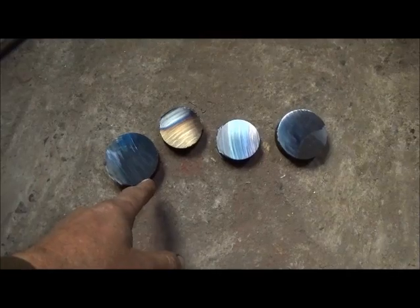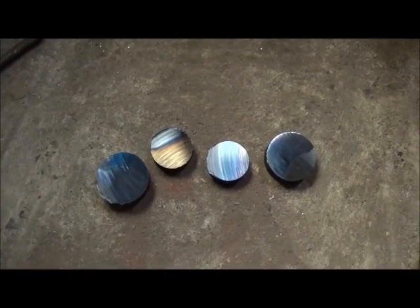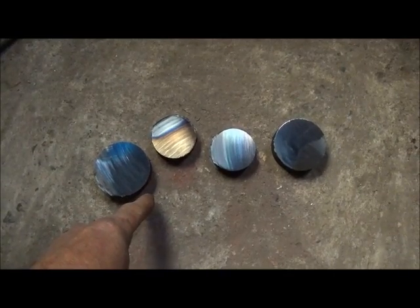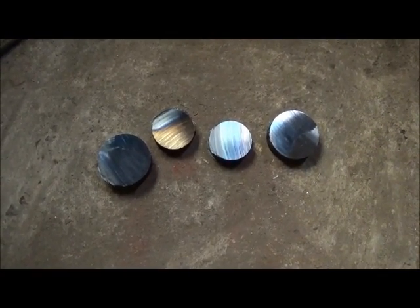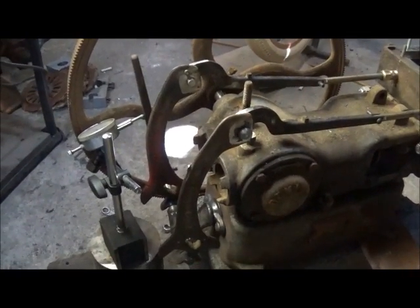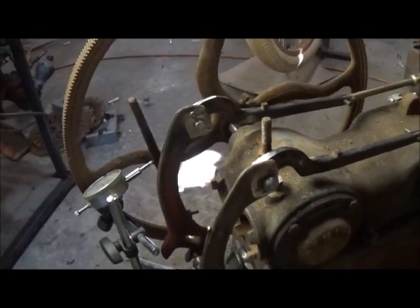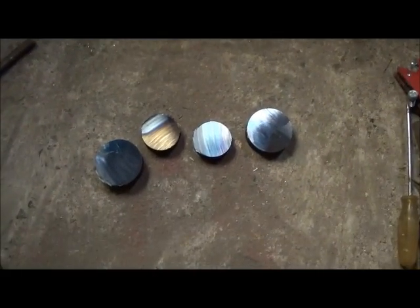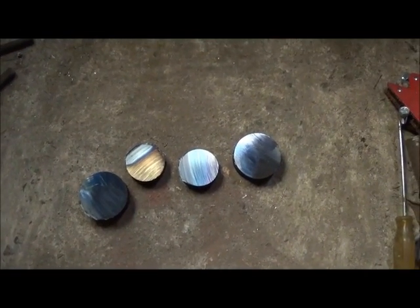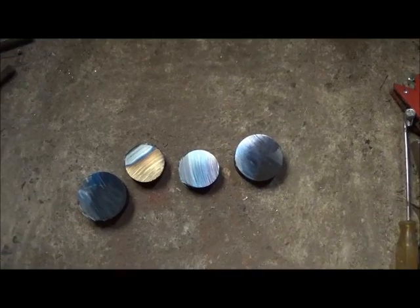There's only going to be a quarter-inch wall thickness, so instead of drilling and tapping I'll mill just a little flat on them, weld a nut on, and then I can screw a rod into that nut and run another nut up on the rod as a jam nut. We can always weld it all the way in and grind it to look decent. I haven't done anything else on the linkage until we get this figured out. Then I'll get everything set up - that'll be the last step, doing our rods. I know I messed up last time with my mind in the wrong spot, but we will definitely drill these a quarter inch off and not some odd ball size like I did last time.